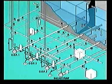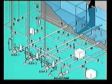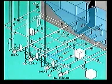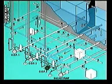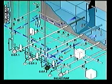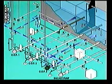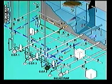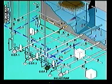You can take cleaning water with any of the cargo pumps, as they can all be connected to the tank wash line. Here you feed the tank wash line with pump number 3 from the starboard slop tank. The same pump is feeding the eductor. The pressure on the wash line should be about 10 kilograms per square centimeter. One of the main suctions in the center line of cargo tank number 1 is opened. The port slop tank is now filling.